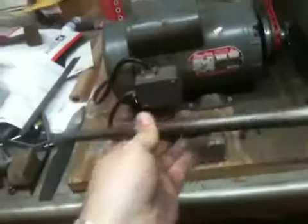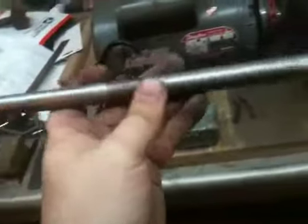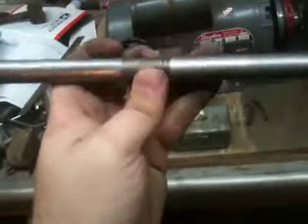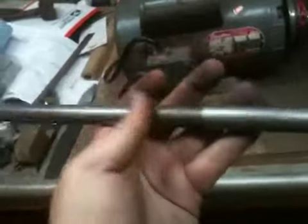And just to show you the old drive shaft here, before I talk about anything else, you can definitely see some added wear there. The pillow block collar, the collar on the bearing, was actually cutting a groove in here where that had loosened up and the shaft was turning inside of that. Obviously that extra vibration rattled the set screws loose, and just really created a magnitude of problems there that was only going to get worse for me.